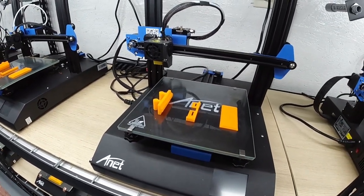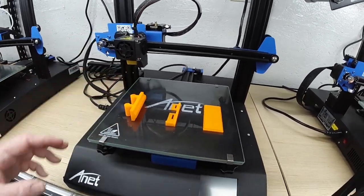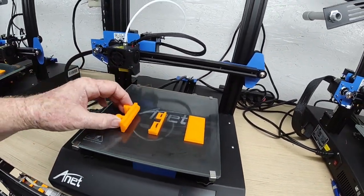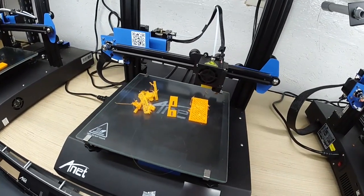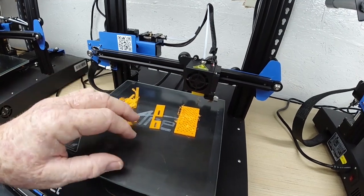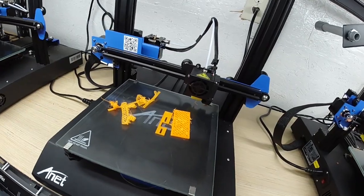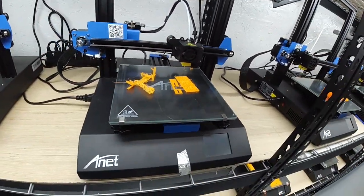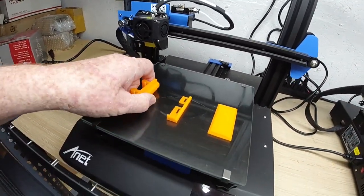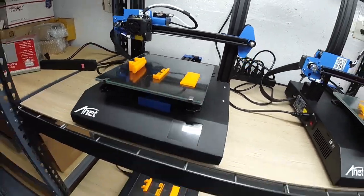We're at nine, ten, eleven, twelve — this is number thirteen. Thirteen was lucky today because it did a good job. Fourteen did a good job, finished the task. Fifteen — I don't know what happened. Well, yes I do — it lost adhesion and started sliding parts all over the surface, so I just shut that one down. Again, adhesion problem. And here, number sixteen — looks like we had good adhesion, parts printed okay.